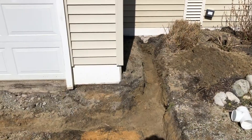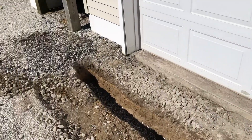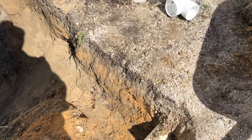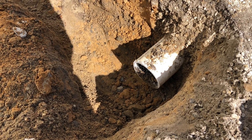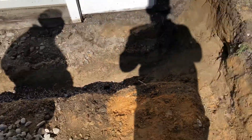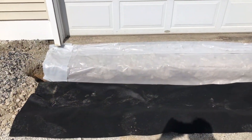Now that we have it all dug out and the grade going well, we're going to put plastic on the inside and filter cloth on the outside. Even though that existing pipe over here is half full, I'm still going to put sock around it and make it still accessible as an alternative, so if the French drain dry well ever overfills it'll still be able to facilitate out that pipe.